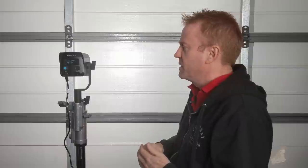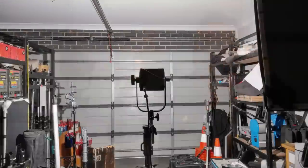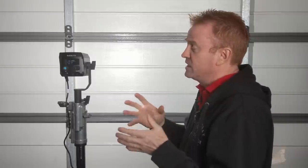In its current operating mode with no reflector on — basically a huge spread wash — this thing is coming in at 365 lux. That's my measurement at three metres in my workshop. Quick disclaimer: if you're outside in the dark at night, it might come in at less, because in my workshop I have a white ceiling and I might be getting bounce off that affecting my readings. But 365 lux is what I was getting at three metres.